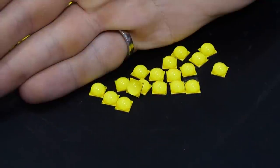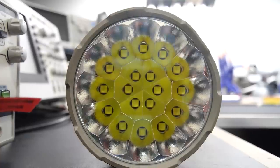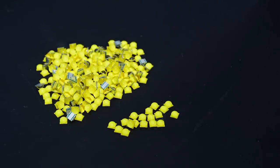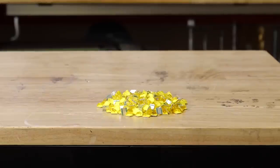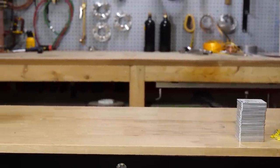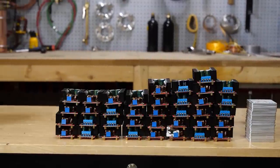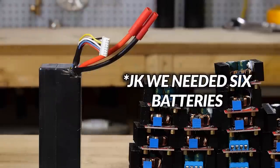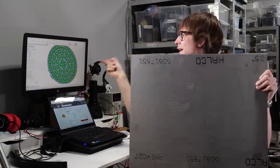Just for reference, this is the current number of LEDs in the world's most powerful flashlight. And this is the number of LEDs in our flashlight — we have 300 LEDs. They are split between 50 boards. Those 50 boards go to 50 constant current drivers. Those 50 drivers are all powered by one battery. Make sense? Good. We're going to take this and make it into that.